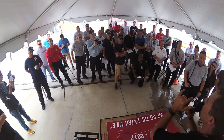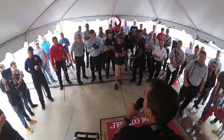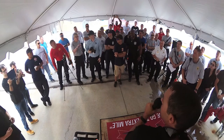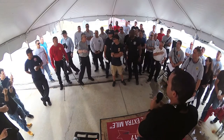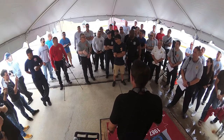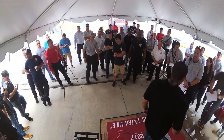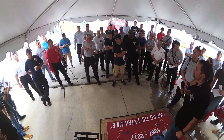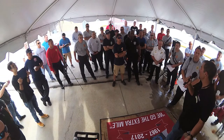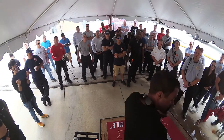Everyone here are firefighters? All firefighters — so you pull up to the building, do you guys send someone into the fire pump room? You should. So you come in, you hook up, you start getting water. One of the purposes of this class is: we send somebody into the fire pump room and it's like, okay, you were assigned the fire pump room — now what? Greg, our pump guy, is going to explain what you'd be looking for when you go in. Is the pump running? And even more important, is it going to continue to run? If the pump is running, that would mean loss of pressure in the system — a head's going off, someone hit a head, or there's an actual fire.